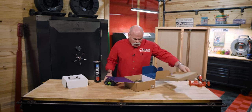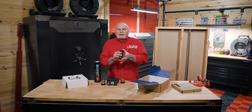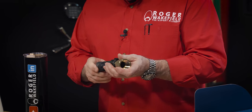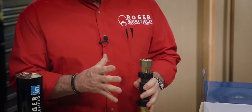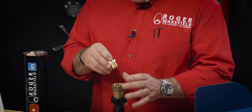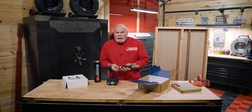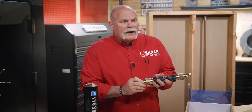I'm going to show you all the connectors here because it comes with the adapters. One of my favorite things when opening this up is this spacer. I can put this together and get everything set up — I would put my O-rings on first — but I can put this together just like it's going to go in the wall. I love the spacer because I don't have to hold the valve or worry about breaking it. I've got my dimensions right here with the spacer.